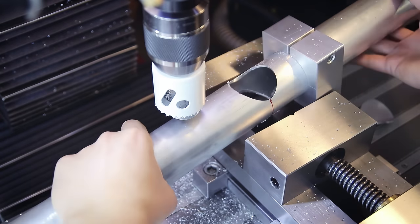Having this only clamped on the corner is a little bit sketchy, but with this thin aluminum tubing the cutting forces aren't that high and I couldn't really figure out a better way to fixture this up. Since this is such a long cut, the hole saw is going to bottom out halfway through, but it's not a big deal — I just use a little hacksaw to carefully remove the cutoff and then keep going. Now I just need to clean this cut up a little bit, drill some more holes, and do a little prep work.